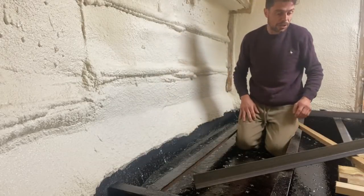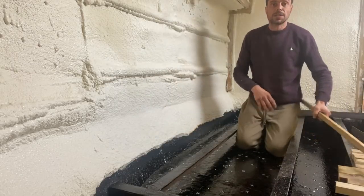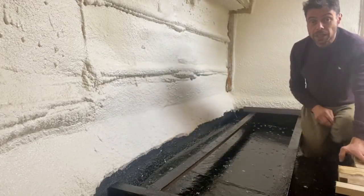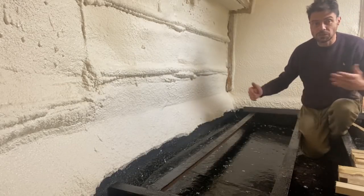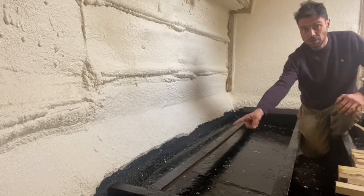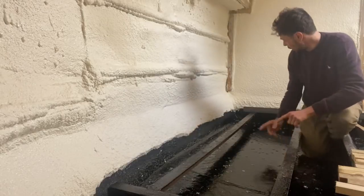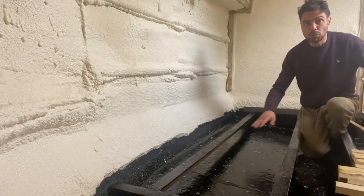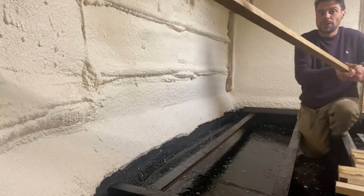So I'm in the bow and I'll explain about the welds that need to be done. This bay here is typical of all the other bays in the boat — it's seven foot long, obviously six foot wide. I'm going to be running my flooring joists along these battens here, and at each end, run them that way. So these will find support all the way along, but there's no support right at the edge.